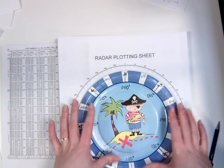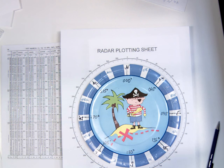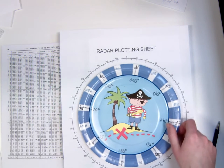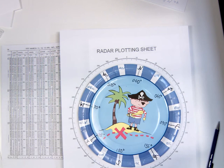This plate represents the compass card, and the radar plotting sheet represents the true bearings around the outside. If the magnetic compass is deflected to the west, the compass values corresponding to the actual bearings are going to be artificially high — that's where the idea of 'error west, compass best' comes from. Likewise, if the compass card is deflected to the east, all the values shown on the compass are going to be artificially low, which is why we say 'error east, compass least.'